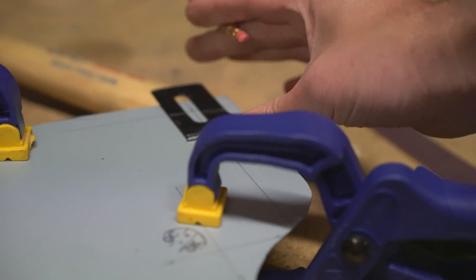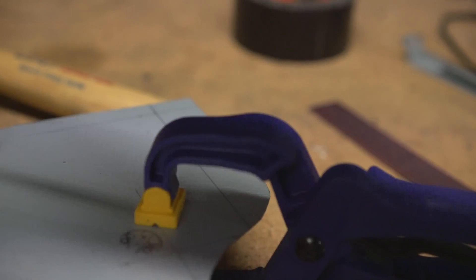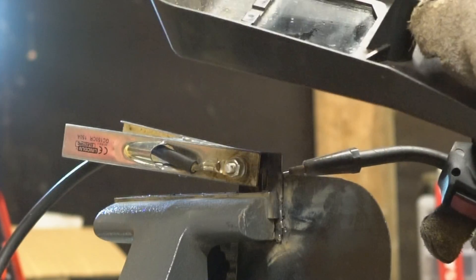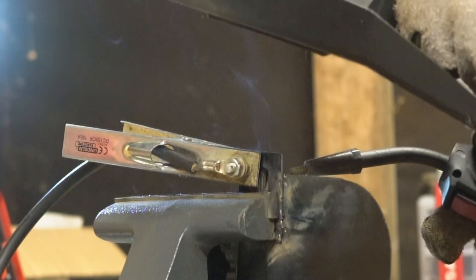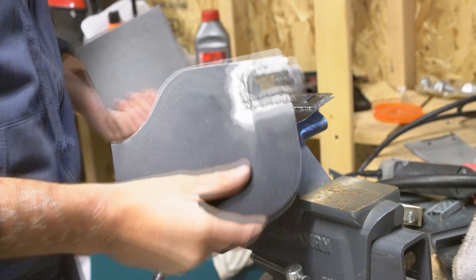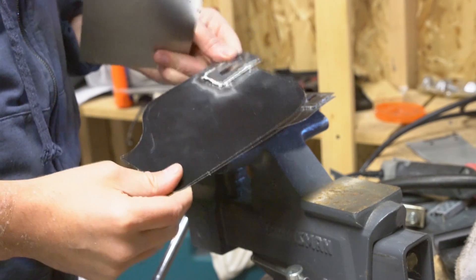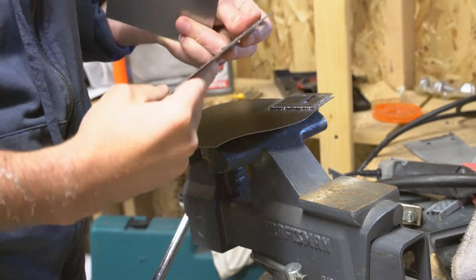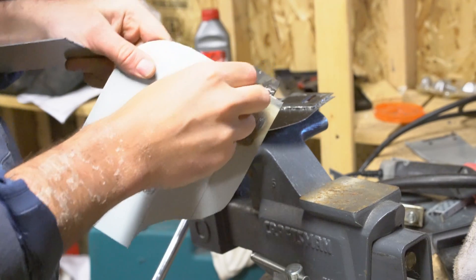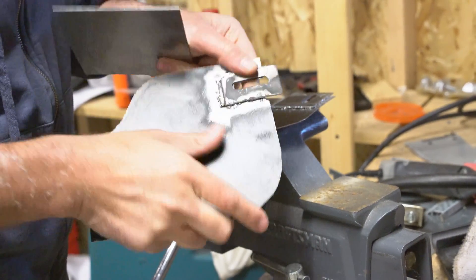So what I'm going to do here is use this slot piece that I've cut off and straighten it out because I've bent the crap out of it, then use it as a template by colouring it in and cutting it out. The welds aren't terrible — they're not terrible. Any welder would know this is too thin really for welding to this; it's just going to buckle from the heat and try to burn through. I had the heat on a quarter of what this thing will do and it went straight through. So I turned down to minimum and it was hard to weld, but it's not too bad.